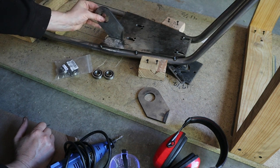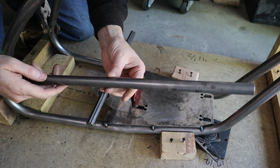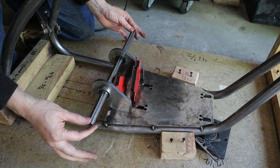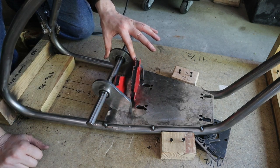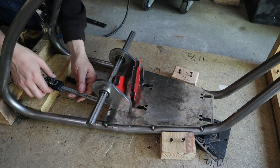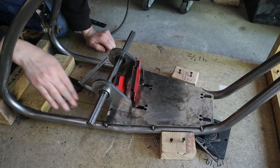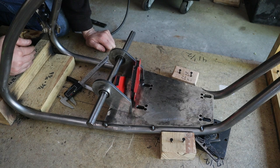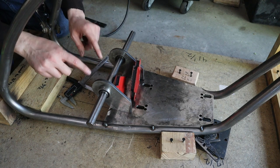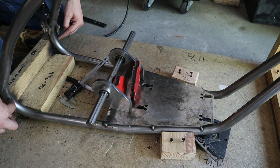Make sure that the two tabs are properly aligned with one another once they get tack welded into place. For the jack shaft axle itself, I'm using a three quarter inch keyed length of rod cut to 15 inches. This 15 inch bar helps align the jack shaft tabs between the two bearings. The tabs from the base of the engine plate are going to measure at three eighths of an inch in. Your biggest concern is not aligning to the engine plate — it's aligning to your axles and your axle tabs.